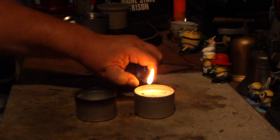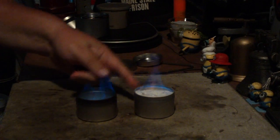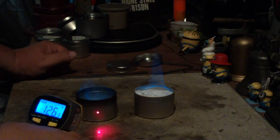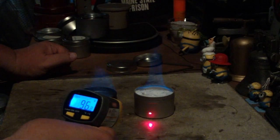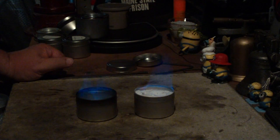Let's turn down the lights. You can light that — there we go. Hopefully you can see on camera: with perlite you get a nice pointed flame here, while the other one is just kind of helter-skelter all over the place, and the flame is down in the burner itself. Already, this can without perlite is up to about 125 degrees, while the one with perlite is running at about 94 degrees — so it's a bit cooler. The perlite flame gives you a nice cone shape, while the other flops all over the place.